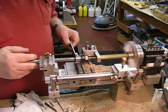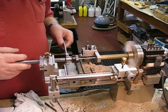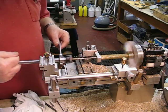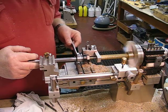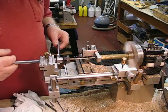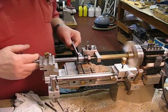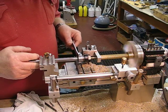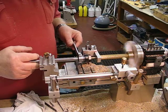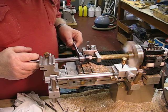It came out very well. The parting off blade was 43 thou wide and the fins were actually supposed to be 26 thou thick. So that made a total of about 65 thou, but I just made it 70 thou. I just kept on turning from 0 up to 0.1 inch, then moved the micrometer along in its holder, reset it, and just carried on.